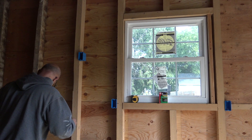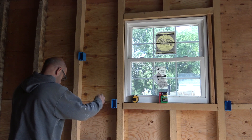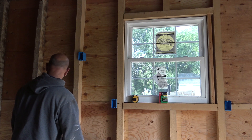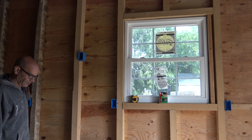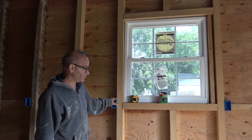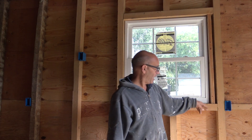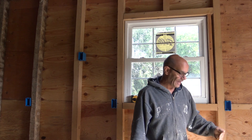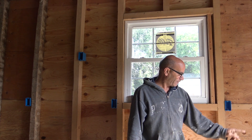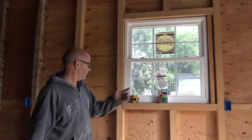Over here we have a 27-inch counter and I've got a 30-inch stove going right here. I have counter space here, so I need an outlet within four feet — that's this one over here. On the other side of our 36-inch window, I've got a 30-inch base cabinet with a 12-inch base cabinet. These outlets cannot span more than four feet.